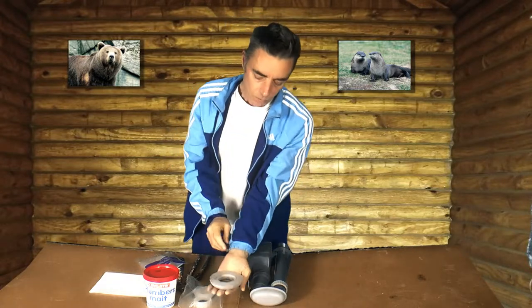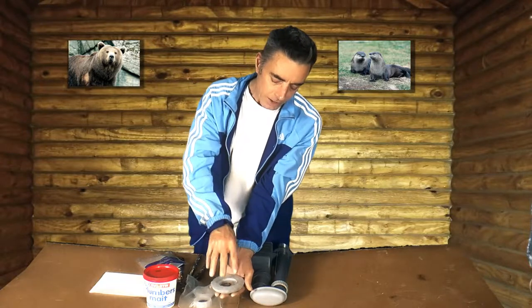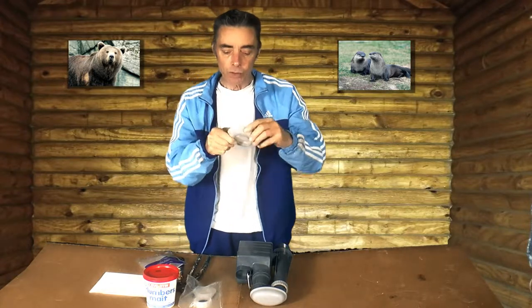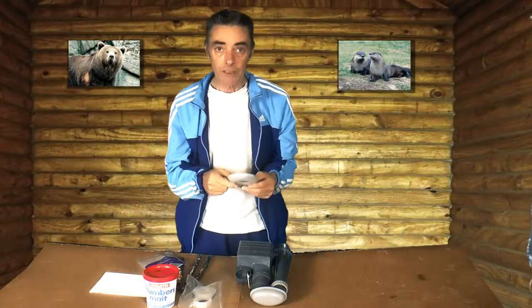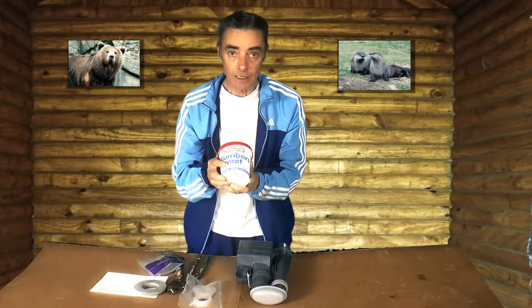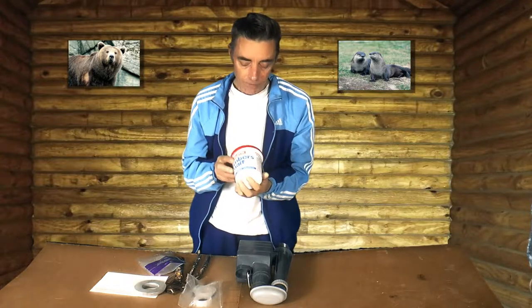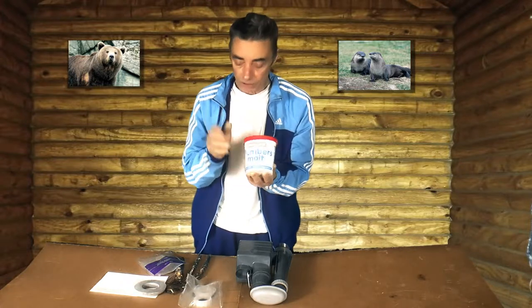This is a bottom washer — the type where the pan sits into the basin. I had an old one in there, took it apart thinking I could reuse it, but it was all squished and done. So if you're going to split the tank, make sure you get one of these first — they're not expensive. Also have on hand plumber's mate, spelled M-A-I-T — it's like a putty that never dries. You may not need it if everything is in good condition, but it's always good to have.